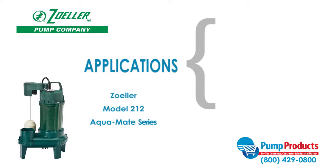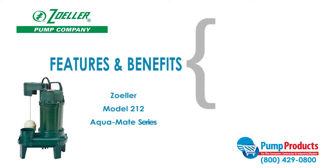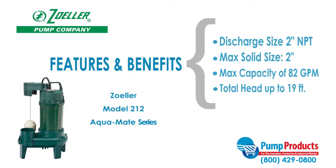The Aquamate series of submersible pumps is designed for use in residential or light commercial sewage applications and can be used to transfer groundwater, effluent, or sewage. Some features and benefits of this model include a discharge size of 2 inch NPT, a max solid handling ability of 2 inches, maximum capacities of 82 GPM, and a maximum head of 19 feet.